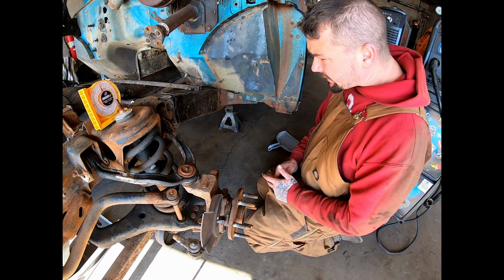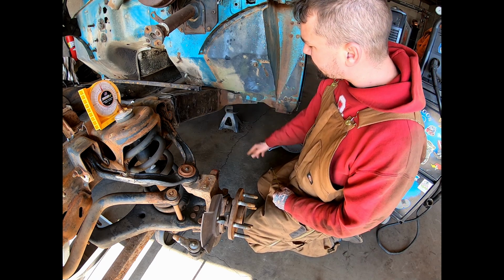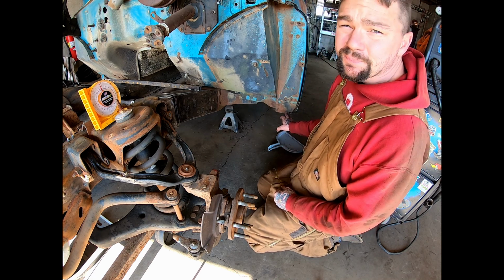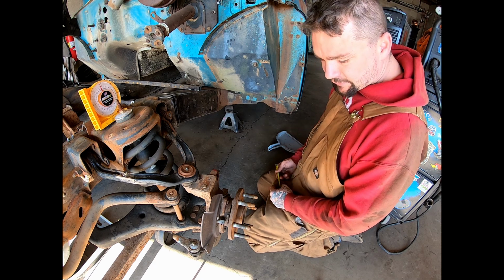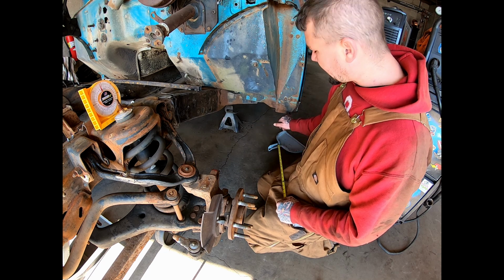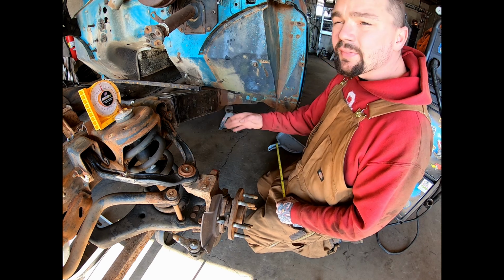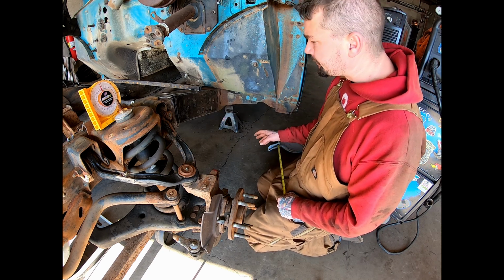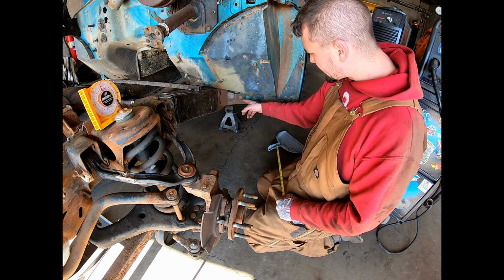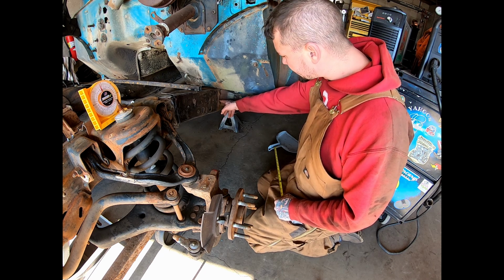I just realized I made a mistake this morning, and that was I have a point over here off the body mount from the frame I was using as a measurement, and one off the body. The one off the body is where we should have 30 1/16. And I realized this morning when I set all that up, I did not come off this one. I came off this one up here. So the math has been wrong the whole time. This mount kind of tapers back, so we can't just run a straight edge. But I got my ruler up here a minute ago.